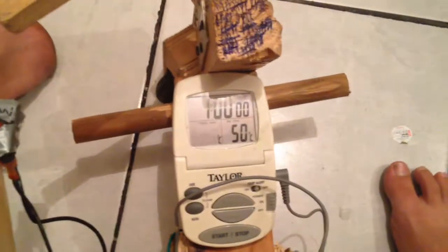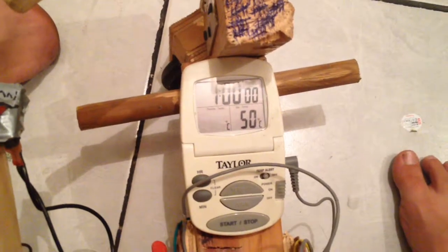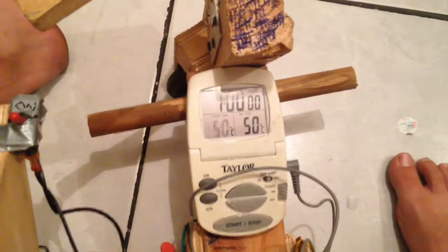I already have this cooling fan from a computer. I'm just doing some laps now — I've already done 8 laps here, the first 5 and then the next 3 — and I'm watching the temperature increase. I started off at 28 degrees and it's climbing quite fast while I'm driving. I can drive at the same time as I record the temperature. If I do 10 laps and I'm at about 50 degrees on the outside of the case, the inside of the motor will be a lot hotter, and that's not good.